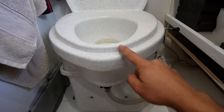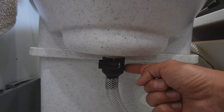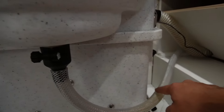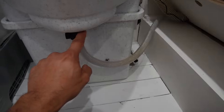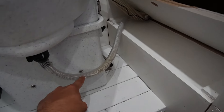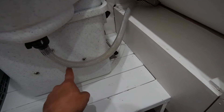Love when projects are almost done — really that just means I have to move on to the next project. So this is what we got: you pee in here and instead of going into the bucket it now goes into this little hose. I'm very thankful for Nature's Head for creating this so I didn't have to MacGyver something — it just fits and works perfectly. This is half inch on the inside, and then this braided tube goes all the way around and right there, feeding into our gray tank. Before, our toilet was on the floor, but I measured it and this height was lower than that pipe. So what would have happened is sink water would have drained into here because gravity feeds to the lowest point. So I actually had to raise it up about six inches so that this would be higher than that pipe and the water would drain down properly.